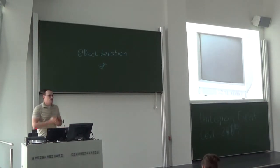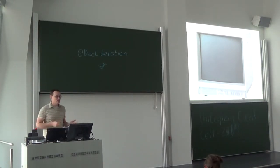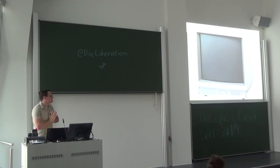So why do we need a new device? Why wasn't the ColourHug good enough? Well, for a few decades, the only display technology that most people had was a CRT monitor. The way a CRT monitor works is you have an electron beam that hits a load of phosphors, and if the electron beam is turned on when it hits the phosphor, it glows. There are very few phosphors for this kind of technology that are stable, cheap, and easy to handle. Consequently, a lot of CRT monitors had the same primaries, the same red, green, and blue, so you could design tools targeted for a whole class of equipment.